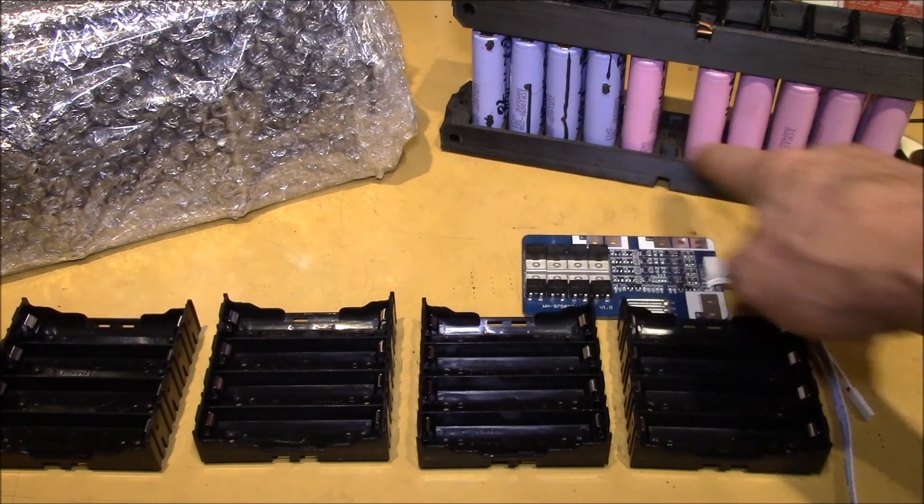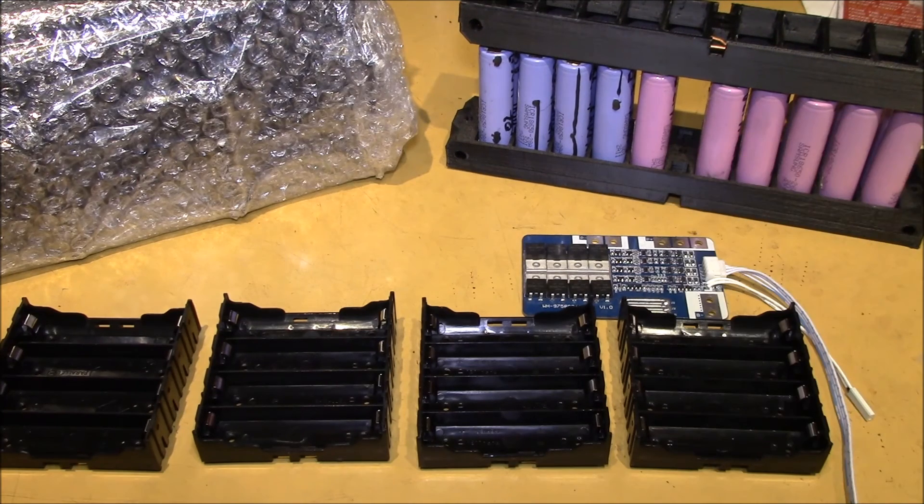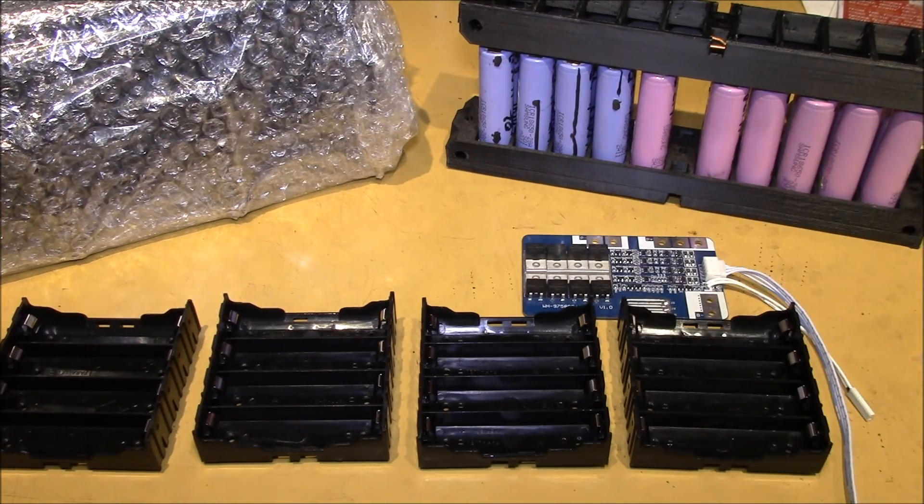The next set of 140 cells might sort out to a different capacity, so I want to try to build these to a pretty similar capacity one after another. I'll use some of the high cells, some of the low cells, mix those in, and see how that works. It may or may not work — it's an experiment. I'll keep you posted, and if you have any comments or suggestions go ahead and post them in the comments section below. As always, thanks for watching.